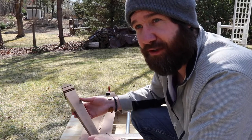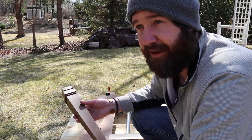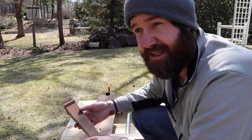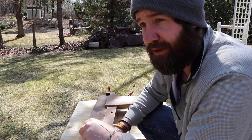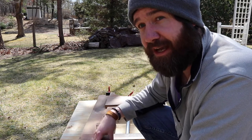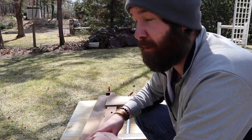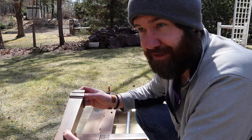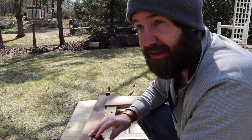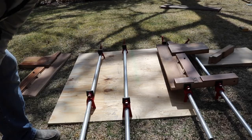So it's good when you're going through this process, never go too quick. Think about every step as you're going, and then you'll realize, okay, what I really should do in this case is get these pilots set up, get the screws set up so I can put them in and out as I need to. And then really put the whole thing together, make sure it's all fitting, and then I'll glue the foot on last as somewhat of an anchor. And that'll probably work out great. You could probably get this in and out without taking the foot off, but it's hard to say. In this case, I'm hopefully never going to need to take the foot off after it's all put together anyway, so I'm going to glue it. All right, just going to do the other side now.